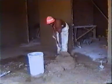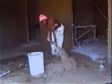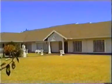The cause is the plaster or rendering is not always mixed correctly, or it dries out too quickly because of the weather, or it just gets old and develops shrinkage cracks. Whatever the reason, the problem is hairline cracks in plastered walls.